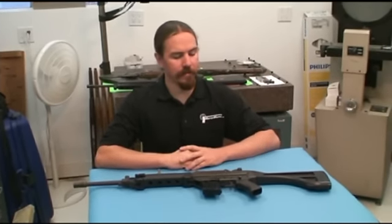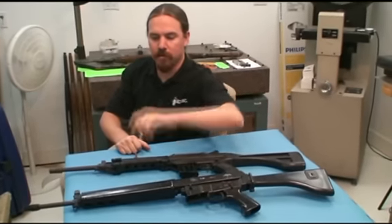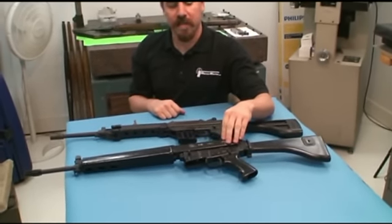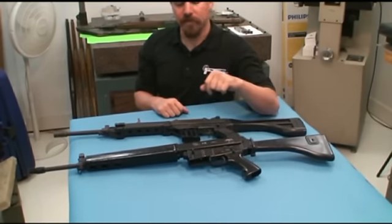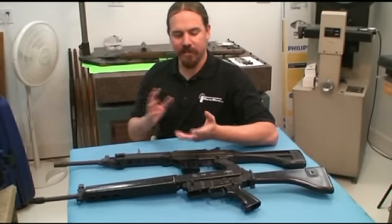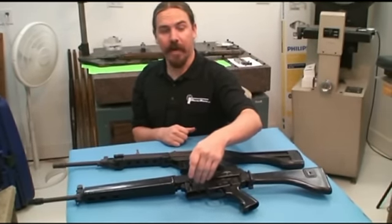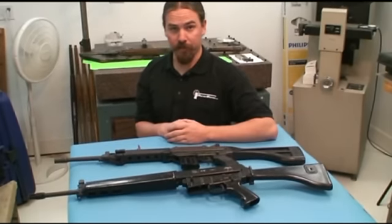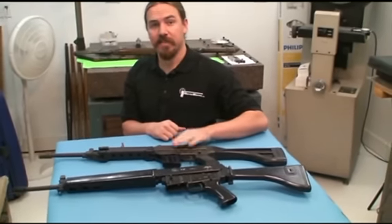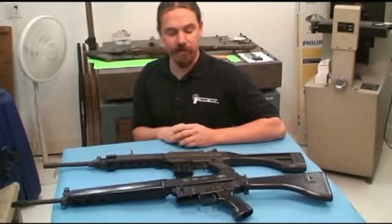The T2 is very similar to the AR-18 in design. The AR-18 was an all-stamped manufactured rifle — the idea was to produce a weapon for less industrialized countries to act as an analogue to the AR-15. So instead of having a cast and milled lower receiver, the AR-18 had an entirely stamped lower receiver as well as a stamped upper receiver, making manufacturing simpler, quicker, and cheaper. The Leader Dynamics took the same ideas and added a few innovations of their own to come up with a pretty interesting rifle, despite looking a bit simplistic.